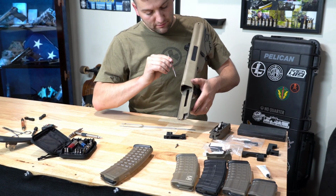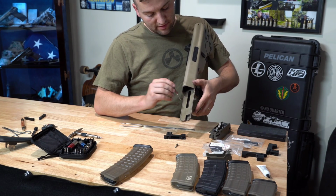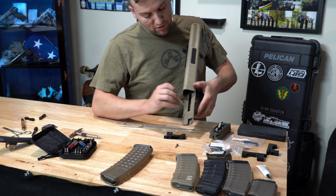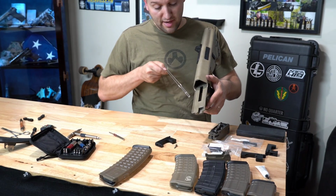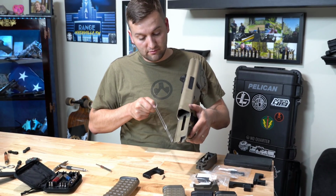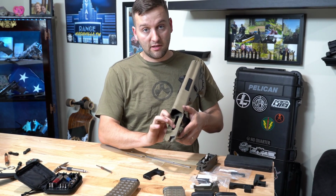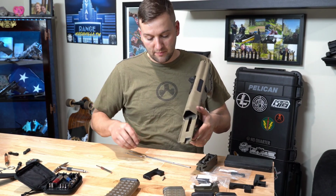looking right here. Straight down to the nose of that inlet, that channel, you're going to see a small rectangular opening which the tongue of the linkage is naturally going to go into. That's where the tongue rests and prevents the trigger itself from going up and down and falling out of the stock. It's how it interlocks.